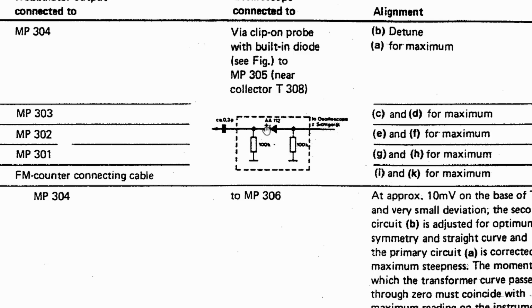And what they have here is a germanium diode. This is the AA112. I think the one I've got is the 94 or something. It doesn't really make much difference as long as it's germanium. Even a Schottky diode would probably work here, but these are better. 200k resistors, one on each side.